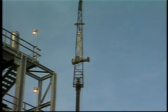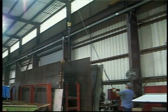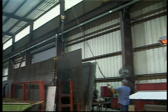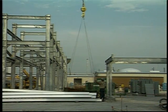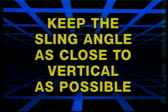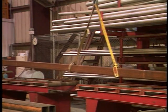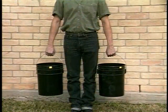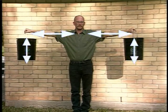These are just common safety rules. Let's refresh your memory on some other important safety rules when using slings. Always lift the load as close to vertical as possible — anything over 10 degrees from the vertical is actually unsafe. Sling angles are different, but the same rule still applies: keep the sling angle as close to vertical as possible. The best example is a person lifting two buckets of sand — both arms lifting vertical transmit stress straight down to the load. If you place your arms at the horizontal, stress is applied downward from the weight and simultaneously from the horizontal, creating two forces of stress.